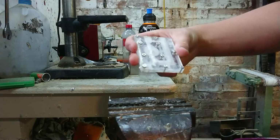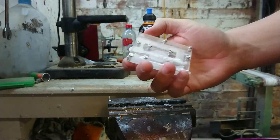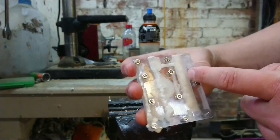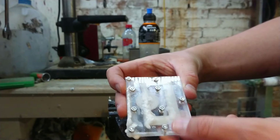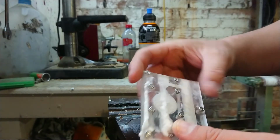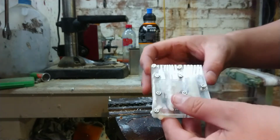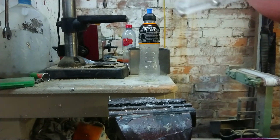So I'm going to dismantle this, reload it and stick another one in. So we'll be back shortly, but before we go, I did gauge the contraction a little bit better this time, and yeah, it hasn't leaked all the way through. And I think I found out where my leak of wax was. It was down the side here, so it wasn't leaking out of the mold, it was leaking from under the blue tack. That one's an easy one to fix.